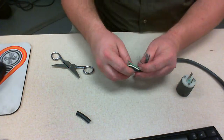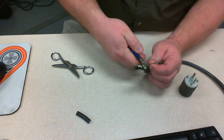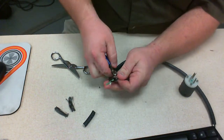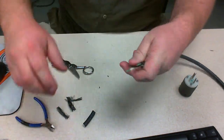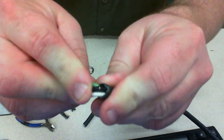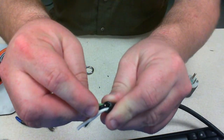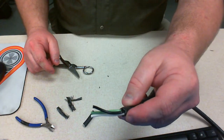Now let me show you one of the problems. I'm going to clean this up a little bit. I'm going to use my diagonal cutters and just snip this off a little so that we can clean this up. Sometimes this material is plastic, sometimes it's paper, but you don't need it — just snip that off. Do you see a problem? That is broken insulation on the worst wire possible. Sometimes you want to do an example — this is what you cannot do. At this point you've got to clip it right here and start over.